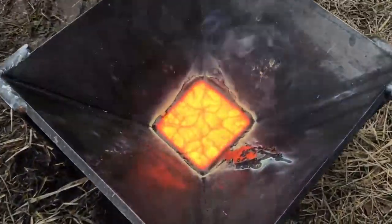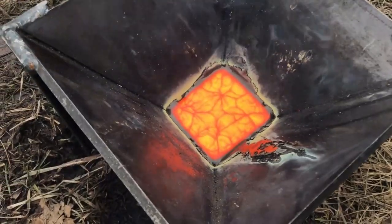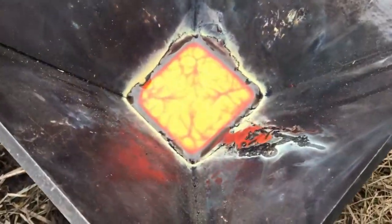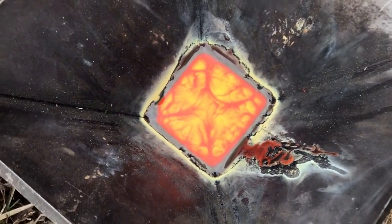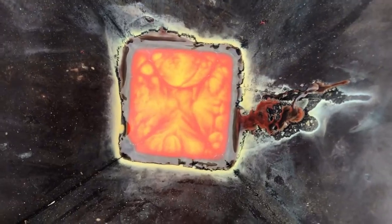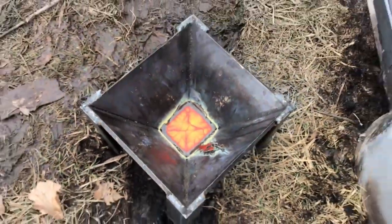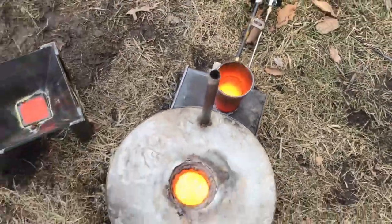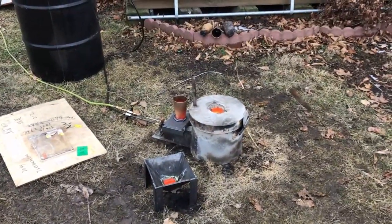Basil, I'm starting to think maybe we want to talk ourselves out of leaching this anode mud prior to smelting it. We've got to pay to get rid of that leach effluent — we're just making waste for ourselves. What are we going to do: take the copper out of it and then still have this toxic material to deal with? I think we should discuss whether or not we want to leach the anode mud prior to smelting. We'll see you next time.